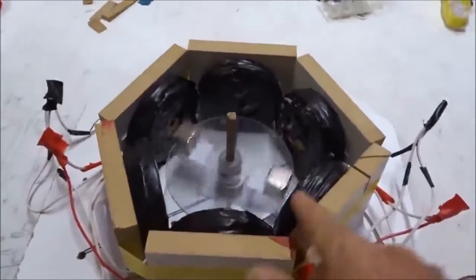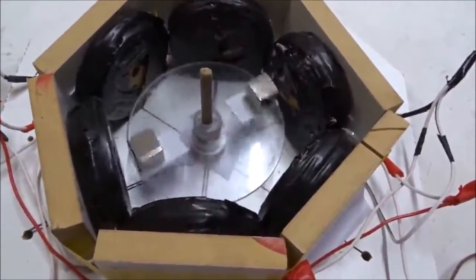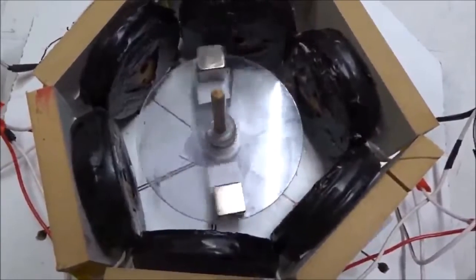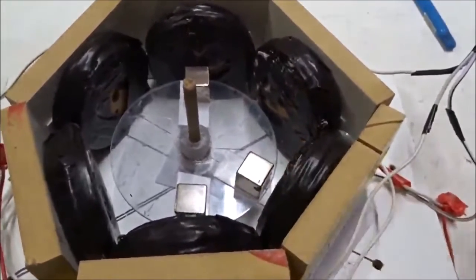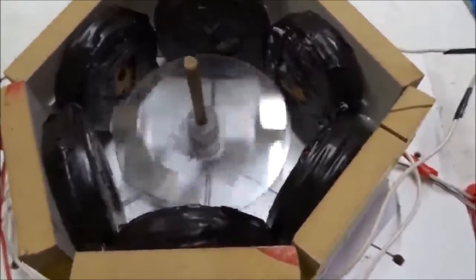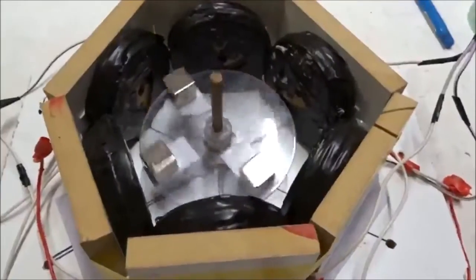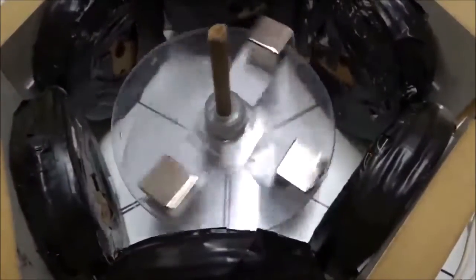Let's wire up all six coils as UVW UVW, still less than one hertz. You can see these two magnets, both end facing out, are trying to line up like a compass with one of three arrangements — either that way, that way, or that way — 120 degrees apart. But they can't consistently decide what to do. Now we've got two magnets pointing out at the two zeros. One magnet's pointing out at 120 here, U and V. This is really quite interesting, because it does give natural clockwise motion. This definitely gives torque — it's the first one I found to give torque. So we've self-started a magnetic motor for the first time. This is with the third magnet at 90 degrees, and this is just super cool. Now it spins clockwise rather than anti-clockwise.